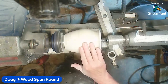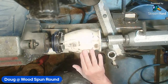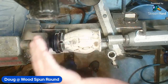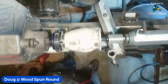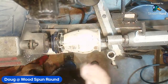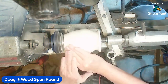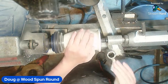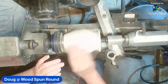There's a bump right there, and I'm not sure what that is. Oh, it's the grain. It's the difference between some of the spalted grain and the hard grain, right in that area. There we go. Good image there. Trying to get just a little bit of shadow on it, so it's not going to show up very well. But in the spalting, there's a little bit of softness as well as hardness, and that's what I'm feeling, some of that difference. Yeah, that's why I'm tending to think more that this is a soft maple. Yeah, it probably is.